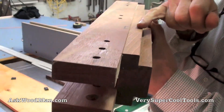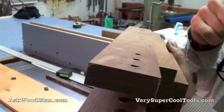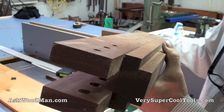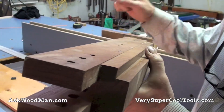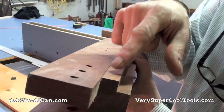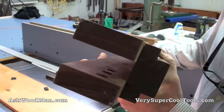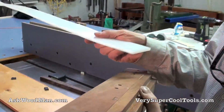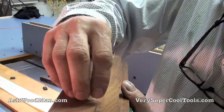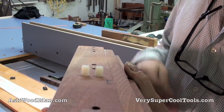Now I'm going to do away with this and go with a slightly different method. Due to humidity changes, even in plywood you're going to get a little bit of swell. So I'm going to make a different setup that will have UHMW glide for the bearing surfaces on the sides and on what's going to run on top. I have plenty of UHMW scrap — it's not going to take very much. And then I'm going to make my fine adjustments using these plastic 3/8 set screws. So let me get on with it.